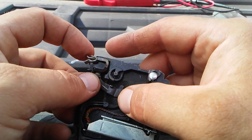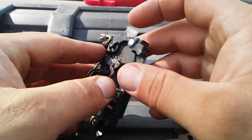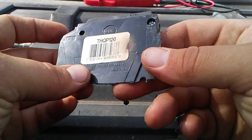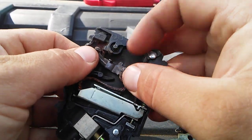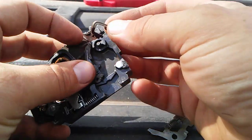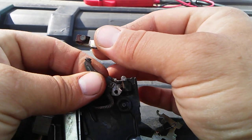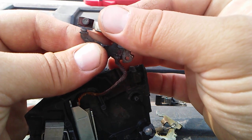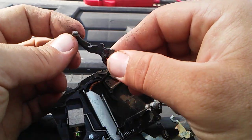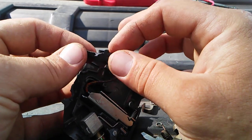You might remember there was a company called Federal Pacific, and they made breakers that pretty much were guaranteed to burn your house down. This might be a trend coming up here. GE circuit breaker — made in the USA — and it completely failed, just sitting there arcing out. I could take this breaker in the panel, wiggle it, and the circuit would come on and off. That tells me it was just these two contacts grinding together making a brief contact. Look at how crappy that contact is — that thing is just burnt off, there's nothing left of it. This component is just completely discolored and burned up. This is too thin to handle 20 amps. I'm almost willing to bet that this same component is used in the 15-amp breaker too.